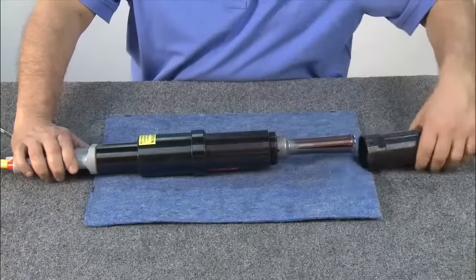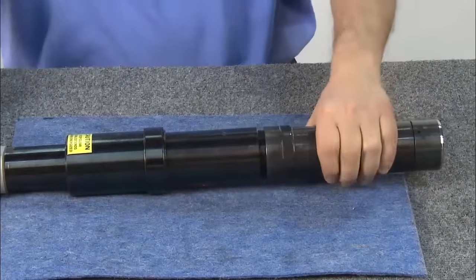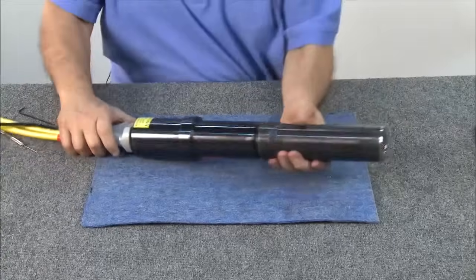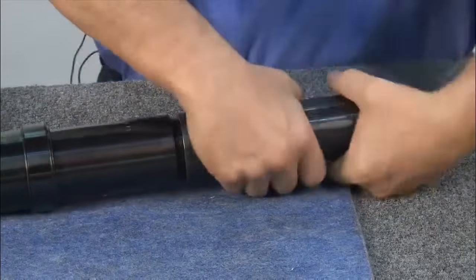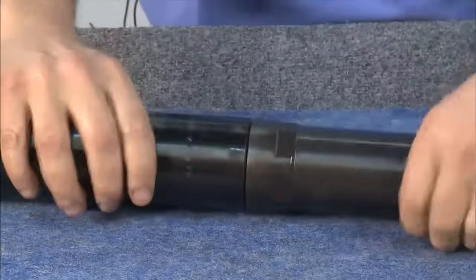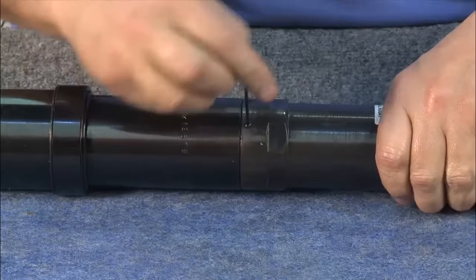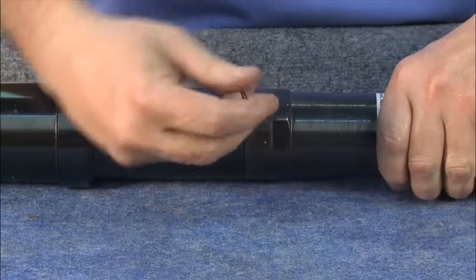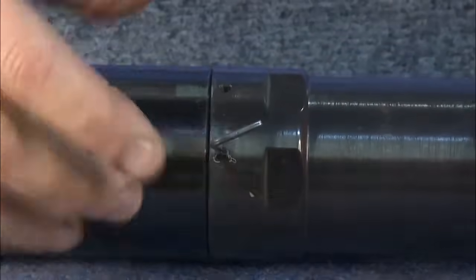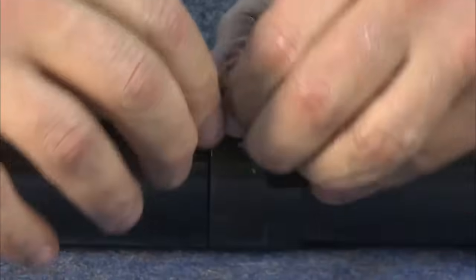Next, cycle the piston all the way back and thread on the anvil holder until it gets tight. Let go of the trigger. Notice that the puller is in the forward position and centered in the holder. Continue to thread the anvil holder down until it bottoms. Once the holder is bottomed, install the lock screw. Turn the holder out and lightly run the screw down until you find one of the grooves in the front gland. Tighten the screw into the groove. Note: you'll know you've reached the groove correctly if the lock screw is flush or below the cylinder.